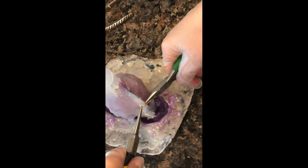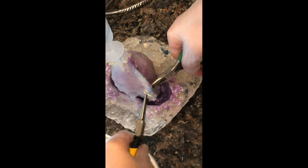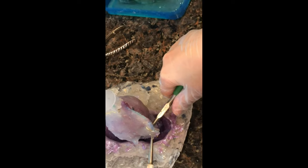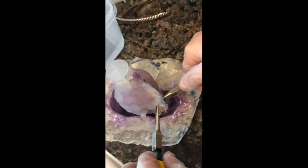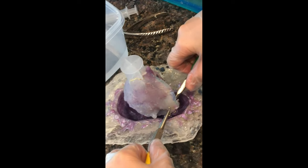I've had an idea to upgrade all my molding tooling, but in order to do it, there's some more machinery I have to buy. I'm fed up of making these silicone molds, which are bulky and heavy, and they go milky after some time. You can't see through them. So I'm going to buy a vacuum forming machine and make thin plates of acetate that staple together and use that as my new mold structure.